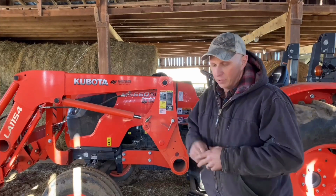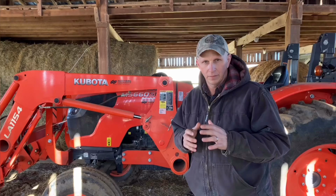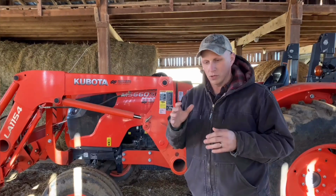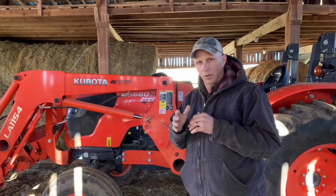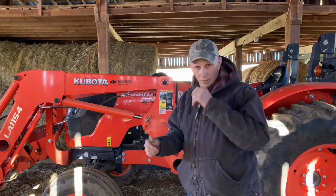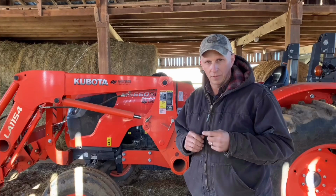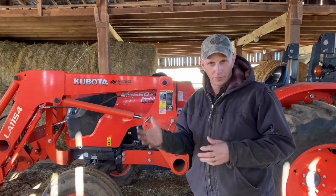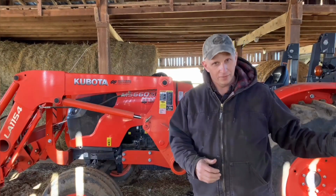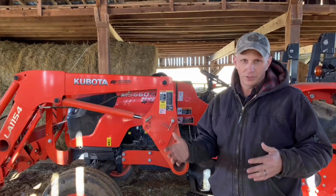So the first thing I want to get into is, what is your plan? Whether you are thinking about getting started, or you are on a small farm and you have got to the point now to where you just can't do things like you were without a tractor, so you think you need to buy one. Well, number one thing is the piece of equipment that you are going to use. That will tell you a lot about the tractor that you need. For instance, if I have a 4-foot garden tiller, that's a 3-point hitch that mounts on your tractor, versus an 8-foot. If you purchase an 8-foot tiller and you get a 20 horsepower tractor, you're going to be very disappointed, because you're not going to get the result that you want.